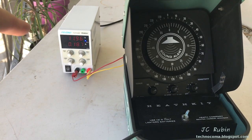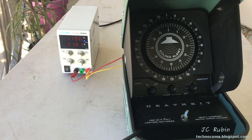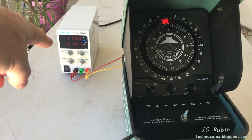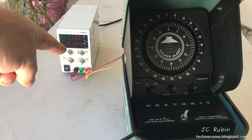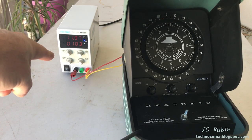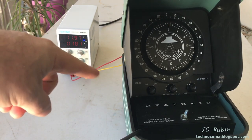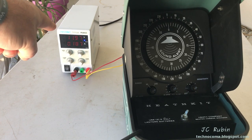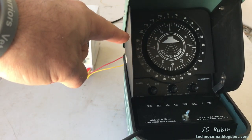We ran into problems with this power supply — it was unbelievable. If we turn the sensitivity up, everything goes off the charts: the current kicks up so high and it produces so much noise. We believe the theory is that the negative is connected to ground over a capacitor, and so much noise crosses from negative to ground that it trips the GFCI for this outlet. I can tell you that if I turn sensitivity really high, the entire circuit dies and I have to go reset the GFCI. Right before that happens, the current goes up to about 1 amp — about 12 watts. So I definitely want to keep sensitivity low.